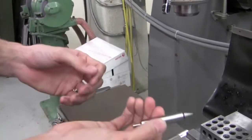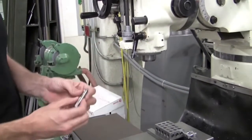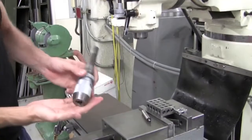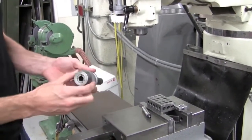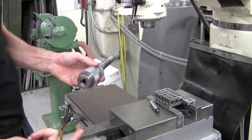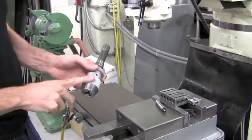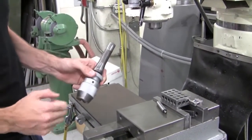To load this into the machine, I could either use a collet — this is a half-inch shank — or I can use a drill chuck like we have here. This drill chuck is used for holding tools of different diameters that don't fit in standard collets and is only meant for axial loads, so drilling operations using center drills, reaming, and things we're going to show in the next couple of modules. We're never going to put an end mill in this, because the side loads applied to the drill chuck will actually damage the internals.